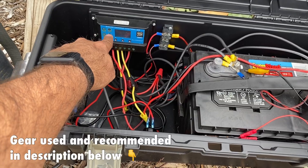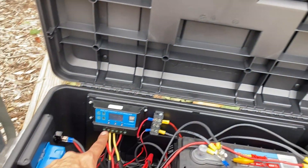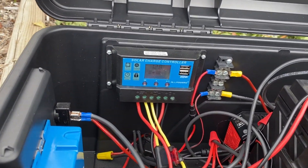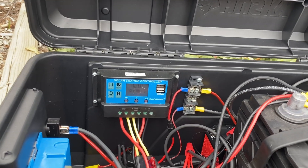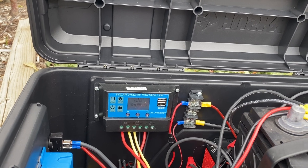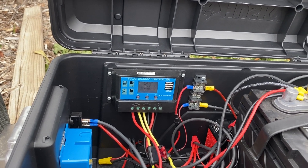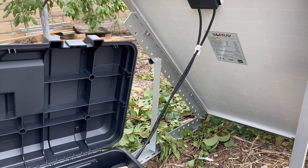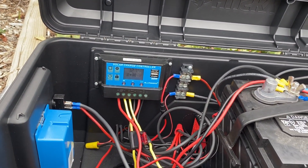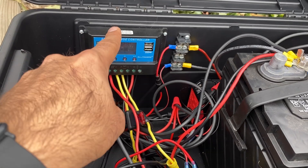Also notice in here — this is our solar charge controller. This takes the current and voltage coming in from our solar panel. This is a 50-watt panel, and essentially the solar charge controller keeps the voltage at a level that's going to appropriately charge the battery. The panel itself puts out a maximum of 17.6 volts — that's way too much to just recharge a battery. What the charge controller does is bring that voltage down to a safe voltage for the battery. The reason the panel has a higher voltage is because on cloudy days, it provides enough voltage to still supply the charge controller.